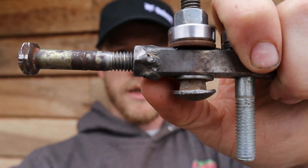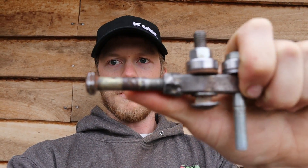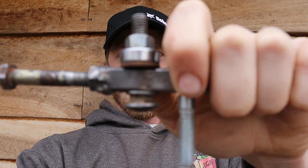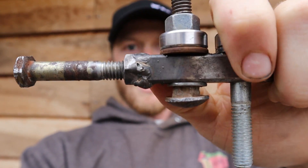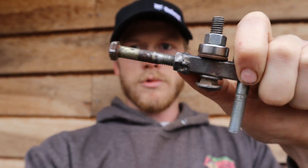One thing I was a little concerned about with this is on the end here where I welded this nut. This is just half-inch square tubing, so this bolt is able to slide down inside of it. That pushes on this bearing over here and moves this one in. I was a little concerned that this weld here might break, but it's actually held up remarkably well.